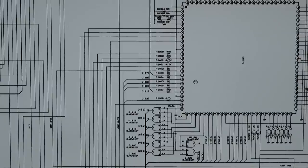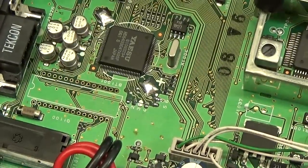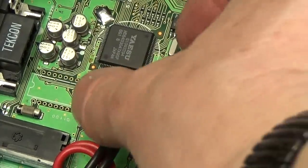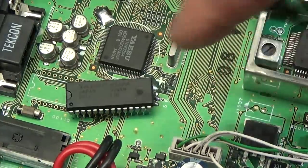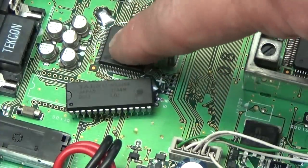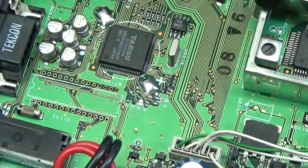Therefore, in all situations like this, I have disconnected the peripheral components from the processor to prevent a potentially broken component pulling down our processor. And you can see it if I go down here to our PCB. So that is where this processor normally sits, like so. And I've taken it out to make really sure that this component will not pull down our signals from our processor. So that is not the problem as well.